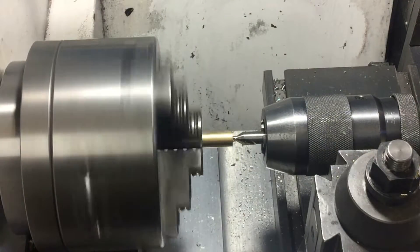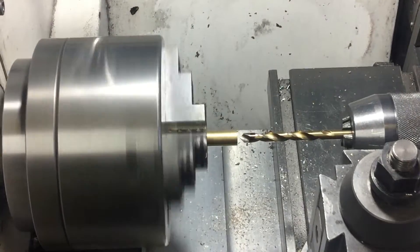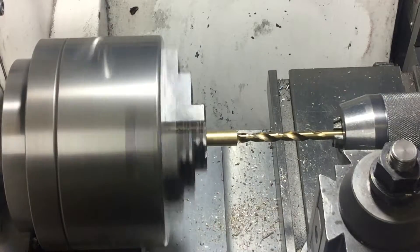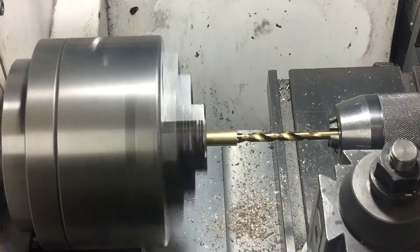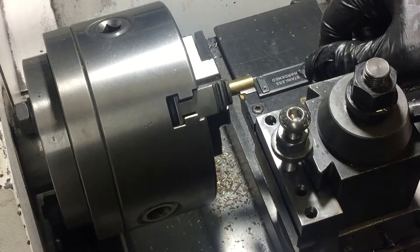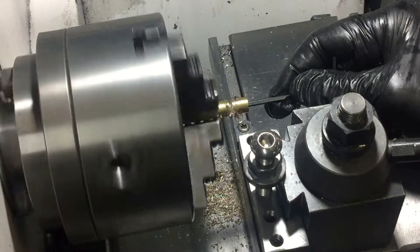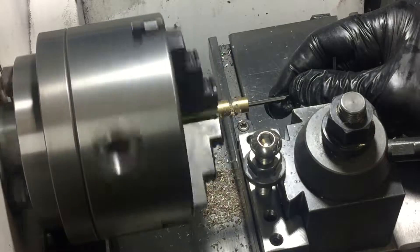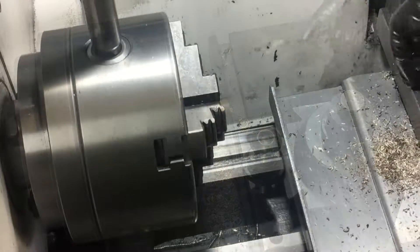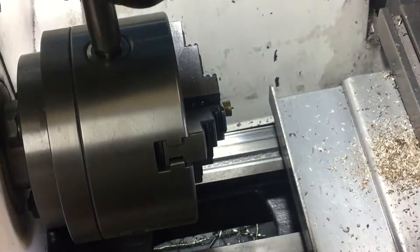The first step is to make the pegs. I'm making the pegs with little brass caps, so time to make the cap. I'm just going to drill a hole in the cap that the stainless steel will slide into. Because brass is so expensive, the caps are just going to be 10 millimeters long, with the cap parted off. I'm just going to turn it around in the lathe, which is a bit of a dodgy thing to do because they're so short.